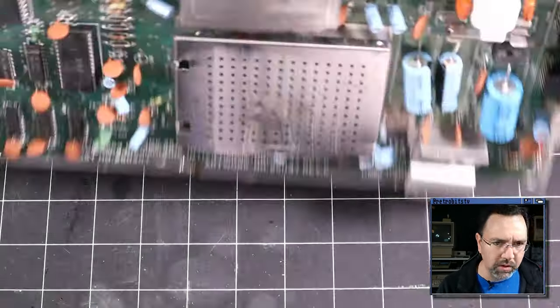All right, what I see here on pin one is phi zero in. That's the one we're interested in. We've got phi here, phi in, and then the phi two comes out here. So let's measure the clock signal coming into the CPU on pin one and take a look if that's good.